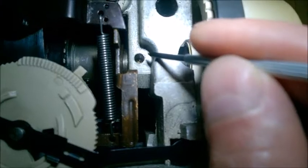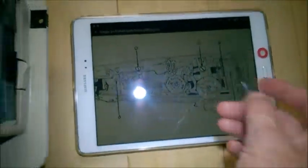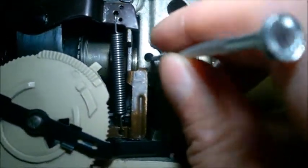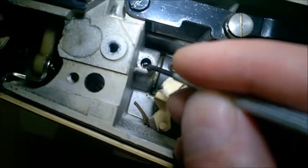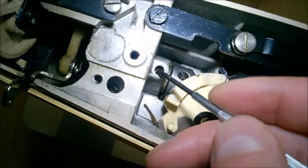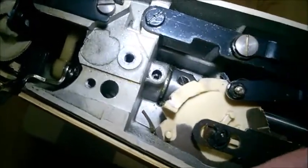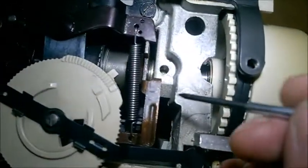In other words, you won't be able to lubricate that segment of the shaft which is supported at that point, and that will obviously cause wear in the long term. It's a good idea to have a look at all the lubrication holes — your manual usually shows where they are. With a magnifying glass, you should really see a shiny shaft part moving when you turn the handwheel. If you don't see movement, the hole is not correctly processed at the factory.